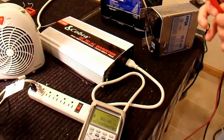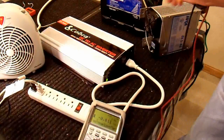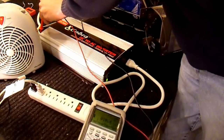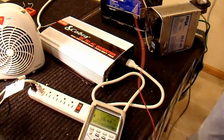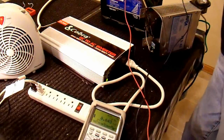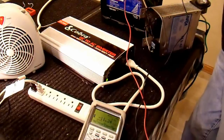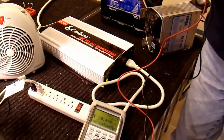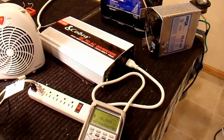What is my incoming battery voltage? This single set of 4 gauge cables is not really adequate to power this inverter. I have 10.6 volts at the inverter terminals, and 11.2 volts at the battery — all that remaining voltage is being lost through this short length of 4 gauge power cable. The voltage dropped low enough that the inverter is unhappy and beeping, which is probably why the output voltage is not correct.